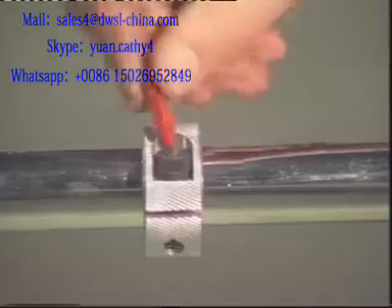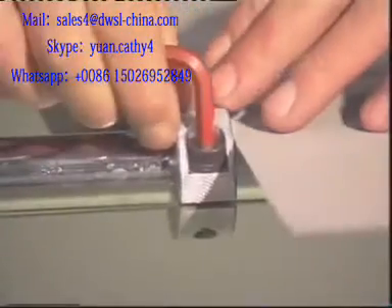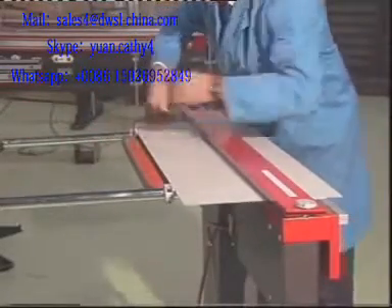When a large number of bends have to be made, all the same distance from the edge of the workpiece, it is very useful to set the backstops. Like the angle stop, these backstops are clamped in position using the Allen key.